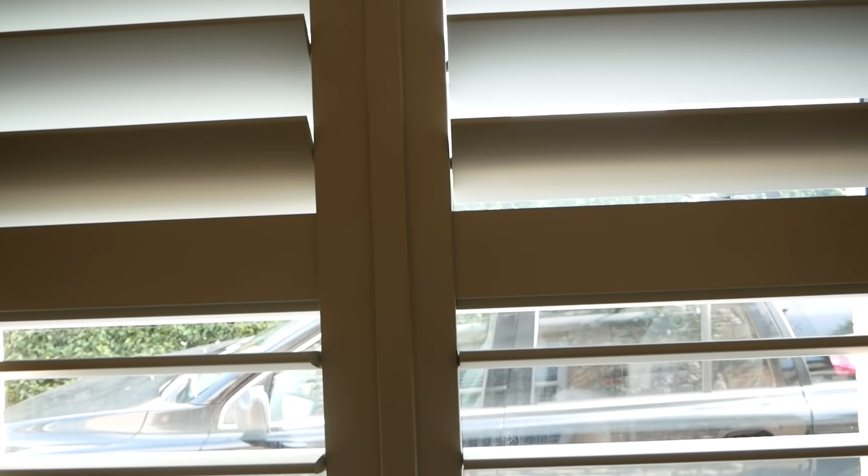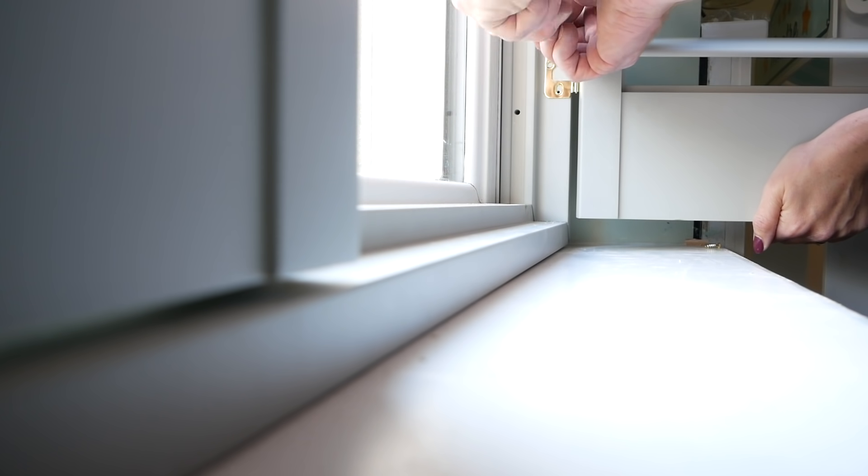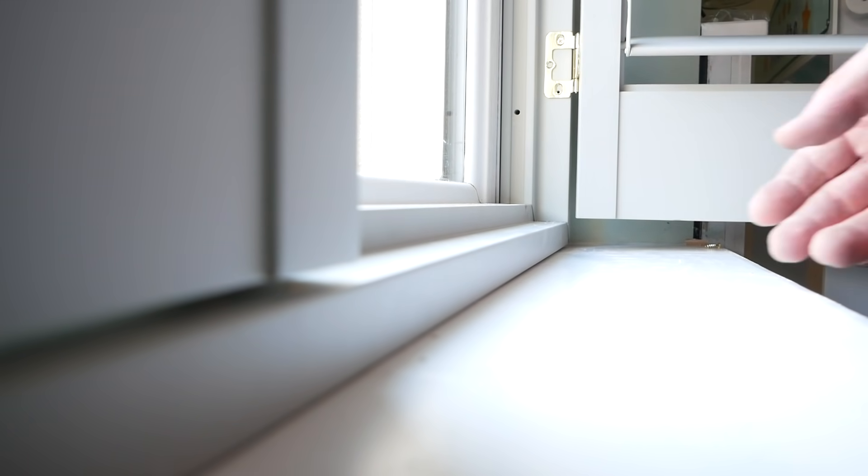You can see the rails — this one just needs to be a little bit harder to push. There's also a gap at the top that's bigger, so this one needs to shift up. If I lift it and then screw it up, I'm going to swing it shut and check it.